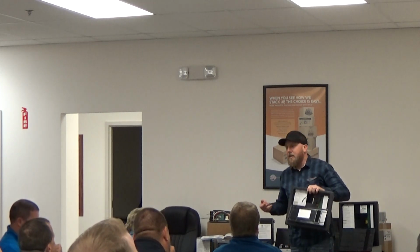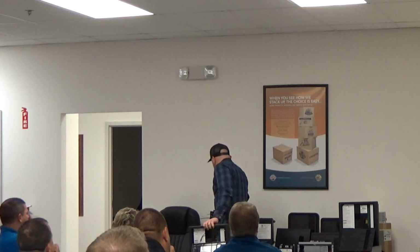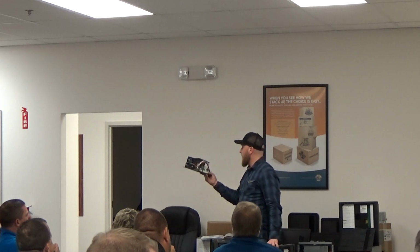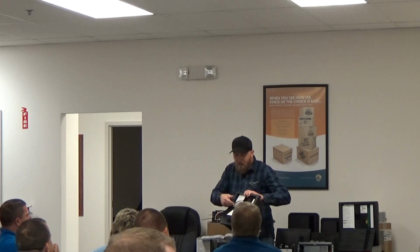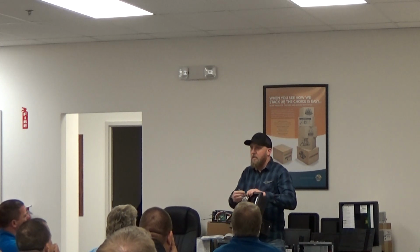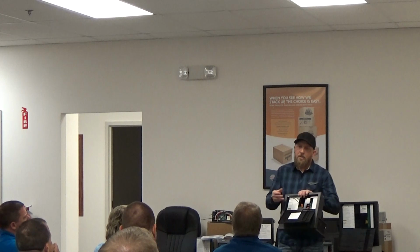Inside this PEC, we have 3 wires that are on our AC side, just like our main board. You got black, white, and green wire. This one's been cut off, but on this black wire is this pigtail. So it's a black wire. This is what would be going into your breaker. This is your hot for the converter. It has this pigtail, and what we call this is a branch circuit.